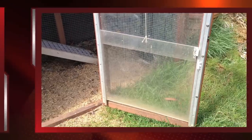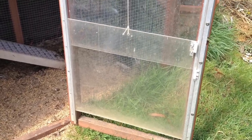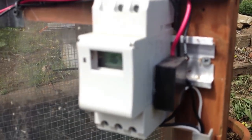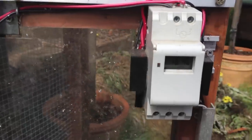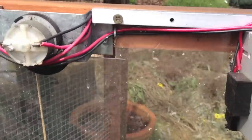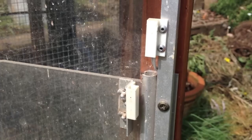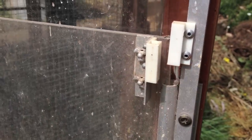And there you have it. Once the timer decides to bring the door up, the timer controls the relays. The relays in this case are sealed 12 volt relays, mounted on the side of the timer switch. The timer switch is mounted onto a DIN rail and controls the motor winder assembly. The door will raise and continue to raise within this sail track guide rail until the magnetic half here reaches the wired half here.